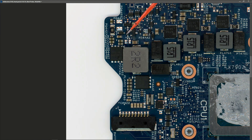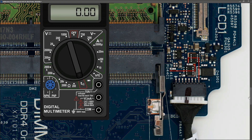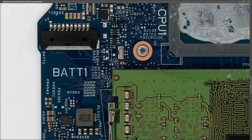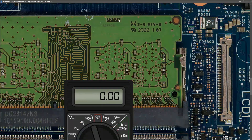The two current sensor resistors are this one here and this one here. I need to identify which one is on the input power rail, and I'll do that with a simple continuity check. With the power switched off and my multimeter in continuity mode, I place my black probe to the source pins on the other side of the second MOSFET - it's easier to use this capacitor which has a bigger pad. I move my red probe to the first current sensor resistor and there's no beep, then to the second one and it does beep - so we have continuity between here and here.